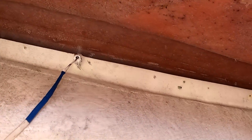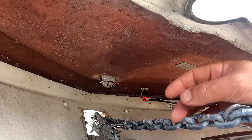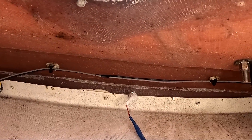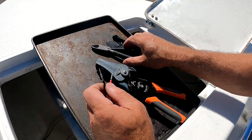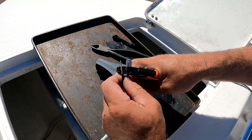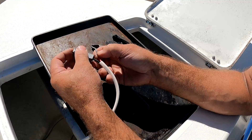We're going to run that wire across the front. You can see the OEM navigation light there and the wires head into that — we're going to use that feed obviously. When you come around here you can see the starboard light sticking through. I'm using Deutsch connectors to attach the nav lights to the wiring harness, and here you can see I'm using the special end crimper to put the ends on. Just push these through until they click.